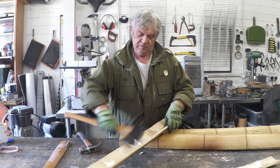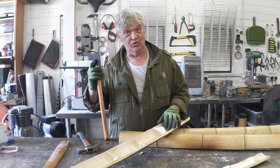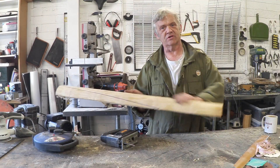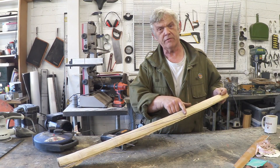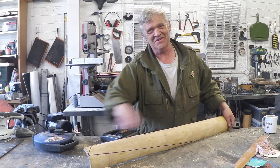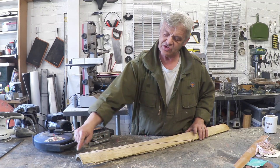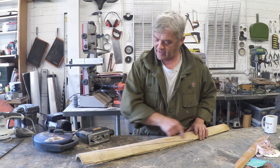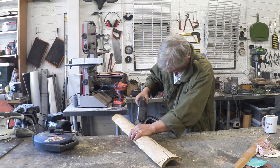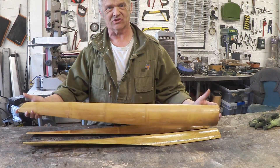Now the nodes — we need to clean them off. We'll do a better job of that with a more delicate tool than a hand axe, but we need to split our other two because we want three pieces like that. So I sanded off the nodes so it's nice and flat, and now I need to cut the actual blade shape. A third of the way down it begins to narrow to half its width, and that little bit there is one-twentieth of the length. So we're going to cut that out. Now remember bamboo has a terrible tendency to split — if you start here and go up, chances are you'll get a split. So you start there and go down, and then the bamboo will come off beautifully.